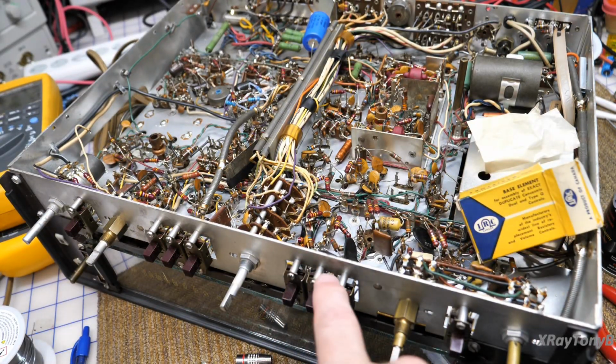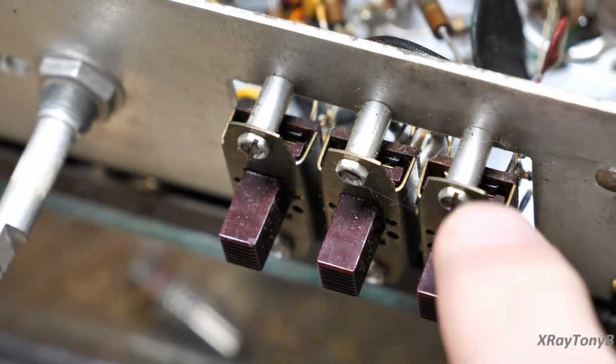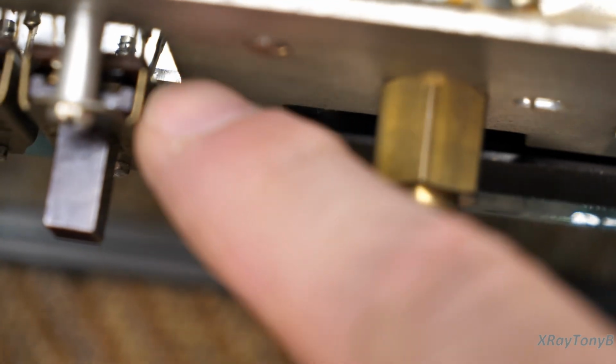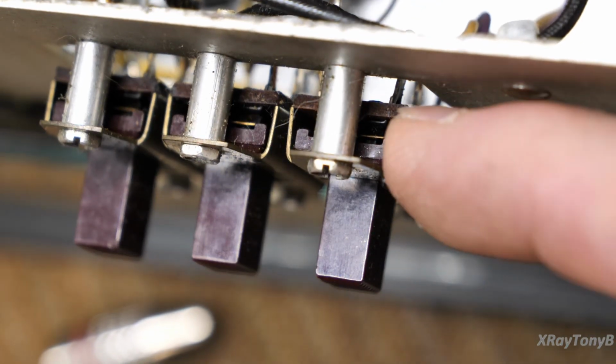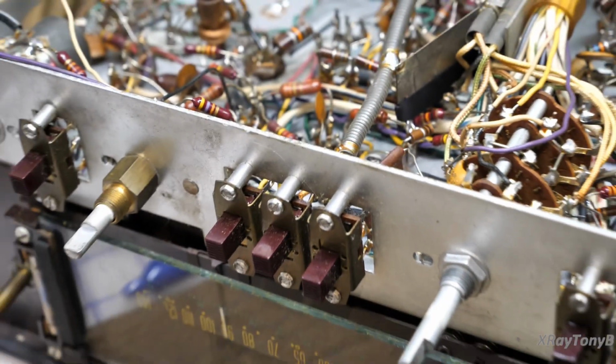So if you look down here, these little switches, they're working wonderfully. And if I zoom way down on it, you can see how wet it is here. You can see where these have been really sprayed with this stuff quite a bit. And you can tell that the fiber in here soaks up all of that DeoxIT, and then all the dust goes in there from it. So it's okay on contacts. It's not okay for these pots.